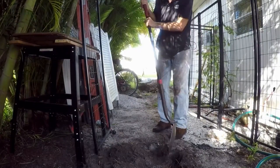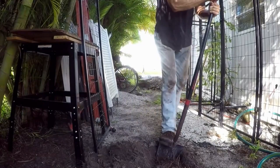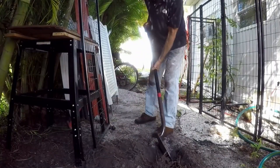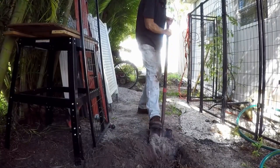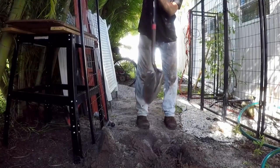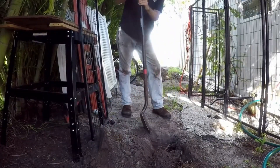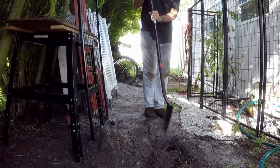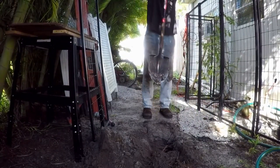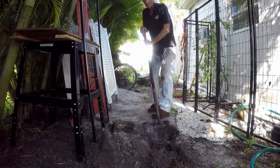Come back, cut them on the side — both sides. Make sure it's wide enough that you can get your shovel down in there, because you're going to end up doing it two or three times. You can see I can pull out some soil; these roots are pretty much just on the top. We'll keep on going — about 15 to 20 feet and we'll be able to get a pipe down in here and drain this area so it won't flood anymore. It does take a great deal of energy, but you can see I'm moving right along.